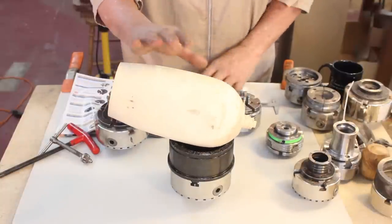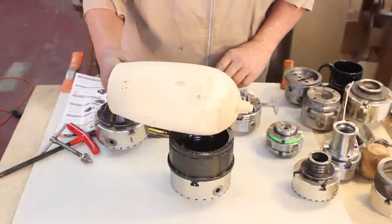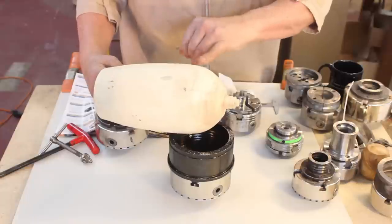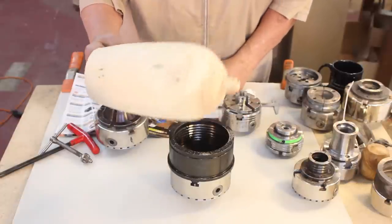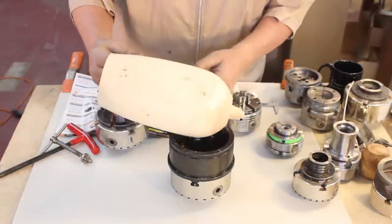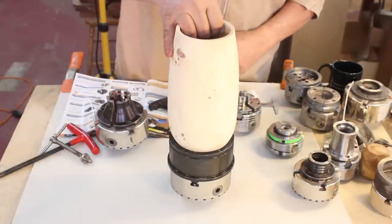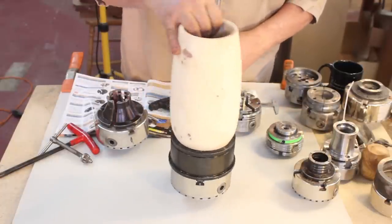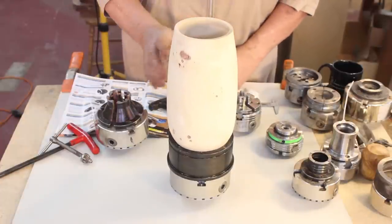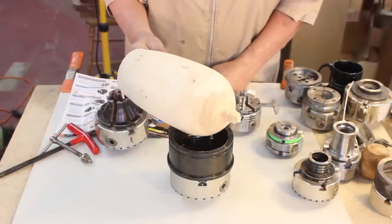You're looking at a very tall closed form that's in the works - it's been drying for a while. I have the remnants of the tenon right here and I probably need to put that back on the lathe sometime. These jaws would be perfect for that - all I need to do is form a tenon higher up that's going to sit in the jaws. There's enough depth there to handle that, so that's a great use of these jaws for a form like that.